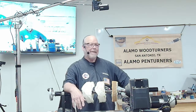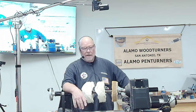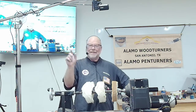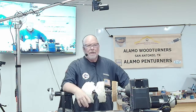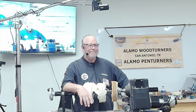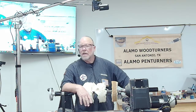$19.39, yeah. Price of $15.69 for the antique stuff here. Minwax, yeah. Like I said, I like it. I just did an ambrosia maple platter, and ambrosia maple has those little pecky holes in it. So I have crushed turquoise, and I put turquoise powder in all the little pecky holes, three coats of the Minwax oil, then my other buffing, and $75 later, it went to friends and family. So it's a nice finish.